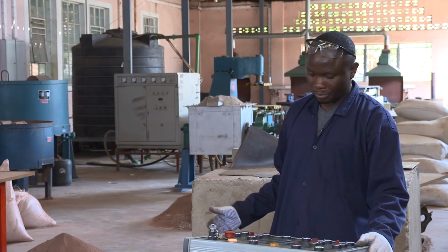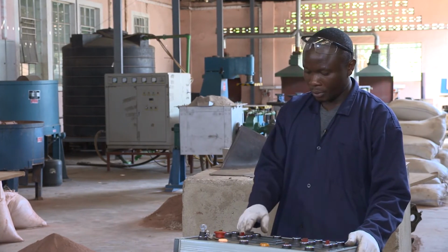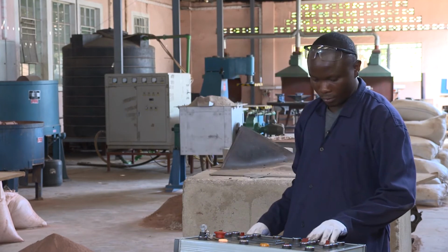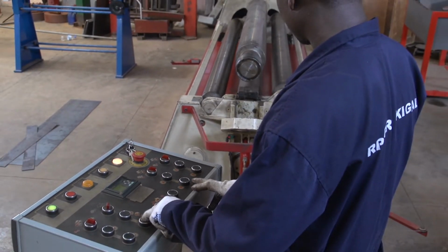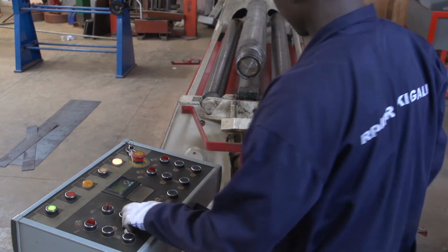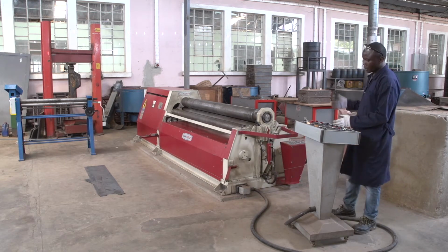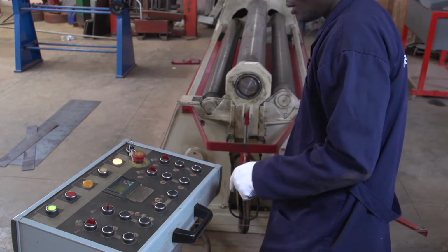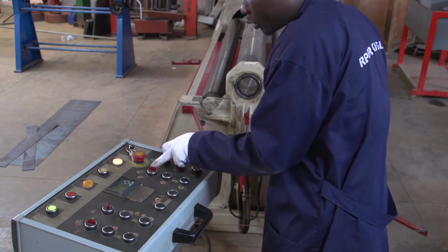Also we move from the right to the left. We have other 3 buttons. These buttons are for controlling the holding roller. This roller is for down. Let's show. Very easy. This is the down roller used for holding a workpiece. This roller is controlled by the second button from the right. Even on those buttons, we have the signal. This signal is an LED. We can demonstrate the roller using this button on the up, shown by the LED color.